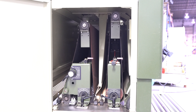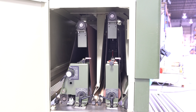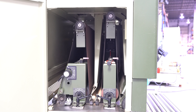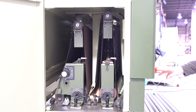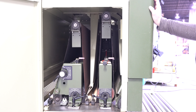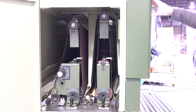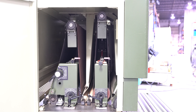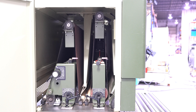We're going to go ahead and turn this machine on so you can see it running. Both of those heads run off of a single motor — the advantage is lower power consumption, about 93 max total amps at 230 volts three phase. That motor is 22 kilowatts or 30 horsepower. The disadvantage is if you're sanding wide glue-ups you're going to have to turn your feed speed down, but this machine only features two feed speeds so you simply turn it down to the first feed speed.